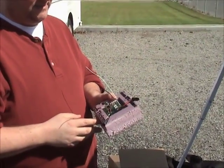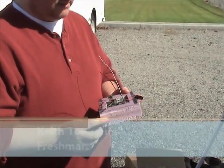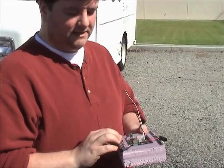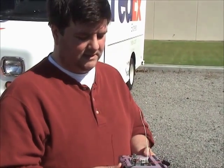I'm using this little Cricket Sat, which is a fairly simple PIC 1572 with a photoresistor and a thermistor on it, with a 433 megahertz antenna. It's going to be transmitting back to the base station whatever the ambient light level is, horizontally.